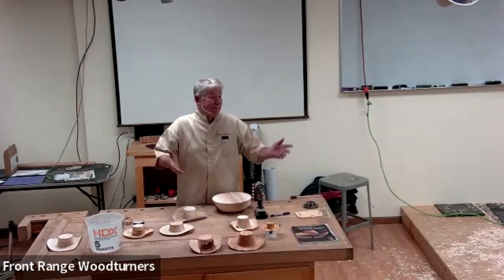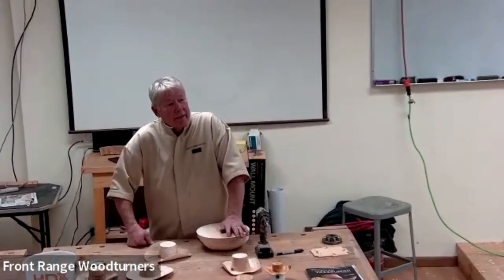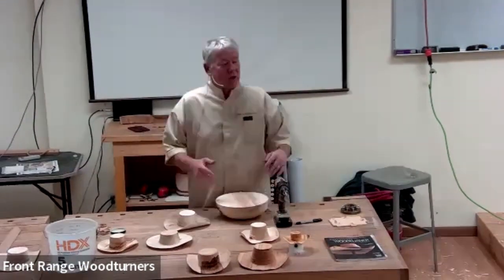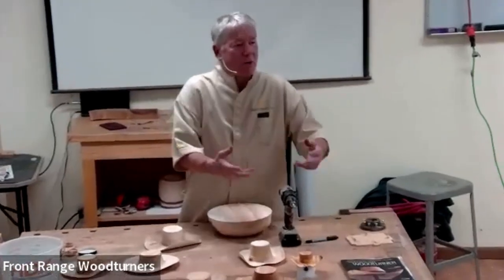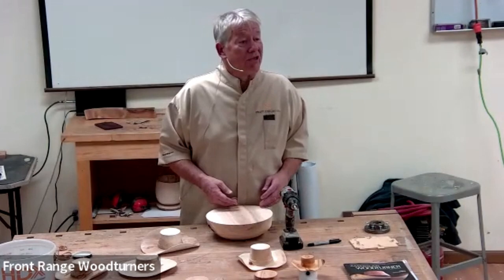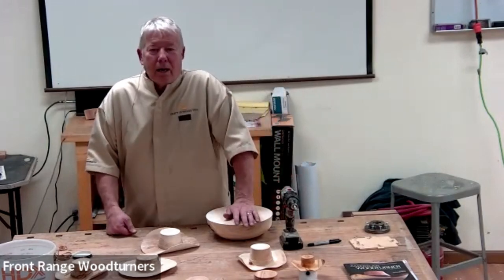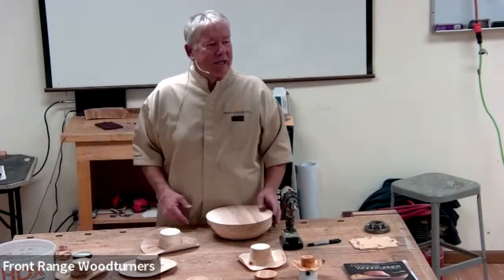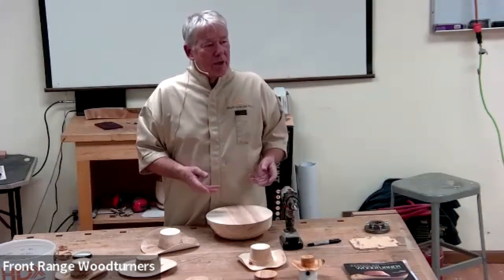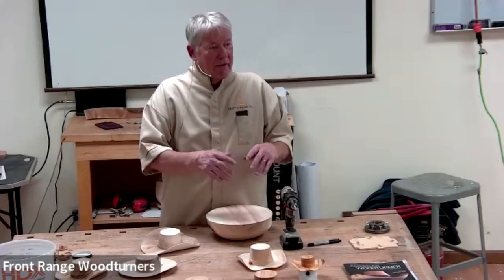And I called him, and I said, Trent, you don't know me, but I saw you demo this. And then I saw him demo it again. And I took my bowl inside a bowl to show it to him, and he looked at it and said, it's too thick. Too thick. I said, I was going to say something nice about you. But I asked a question. I said, how can I get this wood that's already turned? And he said, put it in a pot of water and boil it until it sinks. And then you could bend it.